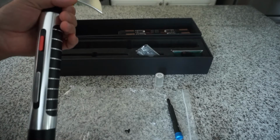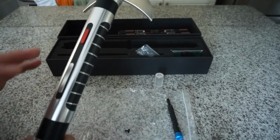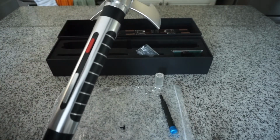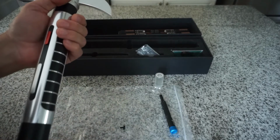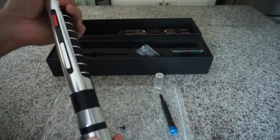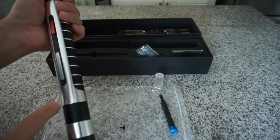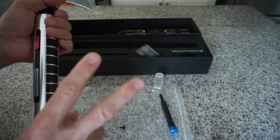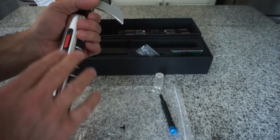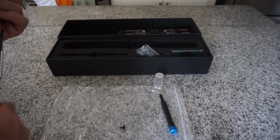As part of these installs, both top and bottom hilts are programmed the same way. They're KR24 mil bass speakers. The volume is set at 2000. When I install for Korbanth, I always put the ProffieOS and the config files on the SD card. There's two of them, on the SD cards. There is a top config and a bottom config.